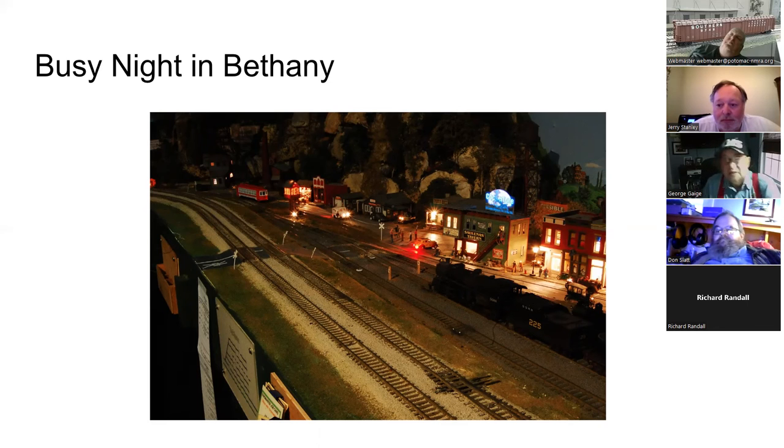So I was kind of frustrated, and I went on the internet and found this circuit. I don't do this kind of thing. I really don't. I don't make my own circuit boards or anything like that. I said, what the heck, I'll try it. I think the first one didn't work. The second one worked. After that, I figured out that they were polarity dependent. You build a whole thing and then you connect the wires from your wall wart and nothing works. Then you realize you have to swap the wires from your wall wart. So that's where I am now.